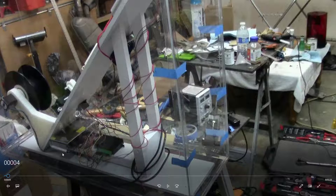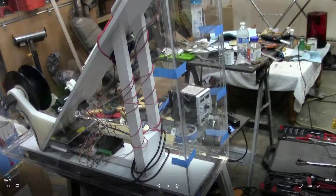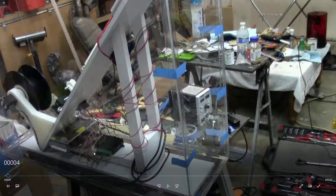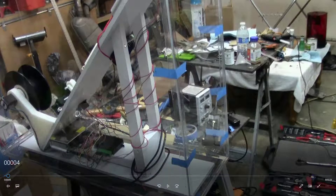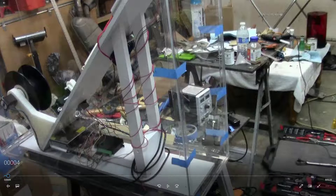This is going to be inside a box that's internally about 40 degrees Celsius because these power supplies start to give out at about 40 degrees operating temperature, especially with no fans. I might put a fan on the stepper drivers to cool them, and that fan will probably also double to cool the filament — it'll suck air over the stepper drivers and blow it past the filament, running double duty. These are some big stepper drivers but even with this NEMA 23 they get extremely hot after some time.